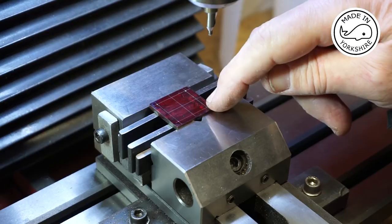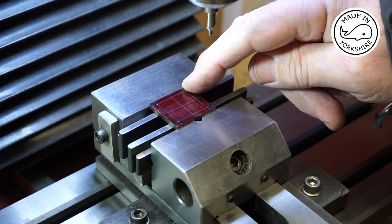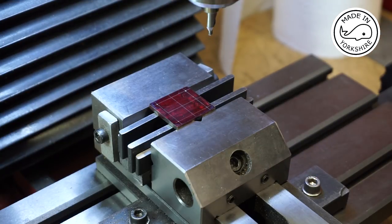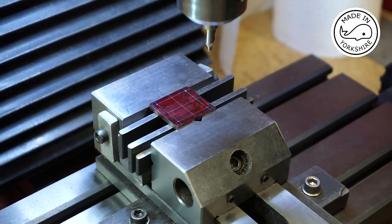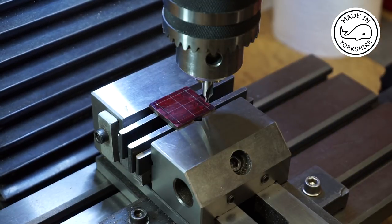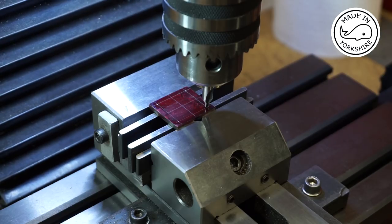Likewise, the distance between these two points is 19.84 millimetres, which is 25/32 of an inch, and that equates to 9 full turns of the dial plus 92 increments, and that's on the y-axis. So I've gone round making the marks, and they're all spot on. So what I'll do off camera is I'll just repeat the process.